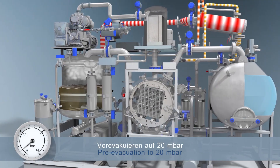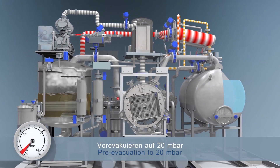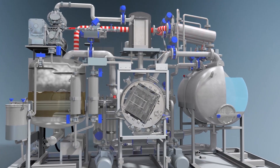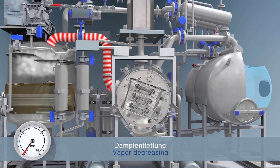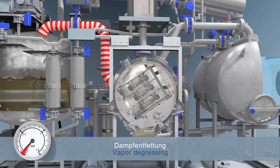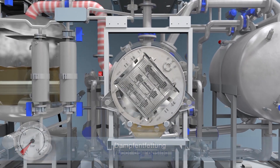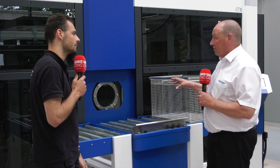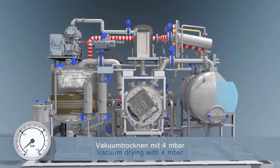Which is amazing. I watched it earlier and it sucks all the air out, and basically all the remaining solvent boils off almost instantly. It doesn't take very long, and so the part comes out perfectly dry, which you don't get with many other types of process. That's right — it's all down to the power of the vacuum technology and the sealing, integrity, and build strength of the machine.